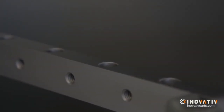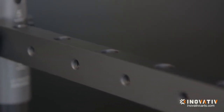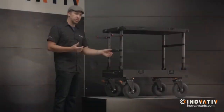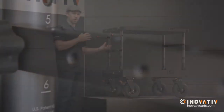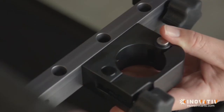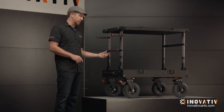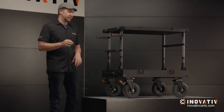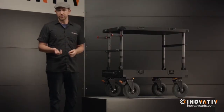There are two accessory crossbars in the standard Scout configuration: a short side and a long side, both constructed of T6 aluminum, anodized gray. They are machined and look beautiful. Not only do they create stiffness to the overall cart, but they adjust up and down and provide a connection point for accessories like the Steadicam system, the camera mount system, the baby pin mast riser system, and the tripod system — using the 3/8-16 tapped holes on either side of the crossbar. In addition to the tapped holes, we have pass-through holes — four on this side, five on that side — which allow for connection of the cable hooks and the middle shelf accessories.